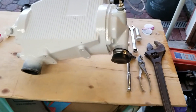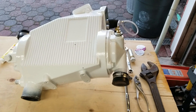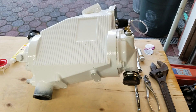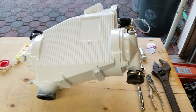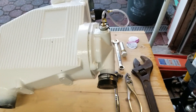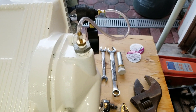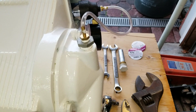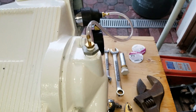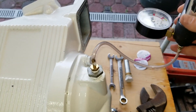I squeezed them down pretty good, tightened them down — they do fine. So right now I'm capping the raw water side. Raw water is either going to move one direction or the other if it's sealed, so I think it's just a little easier to cap the raw water side. What I did is I came up here, removed the zinc, and I just made a little adapter. It's a half-inch pipe thread and then there's a hose barb on there — quarter-inch pipe thread — and then I put a little piece of tubing on here and connected it to this guy right here.